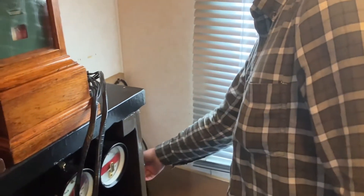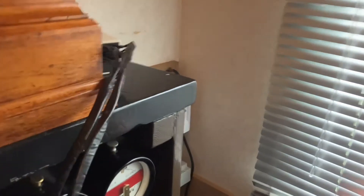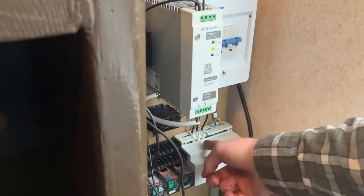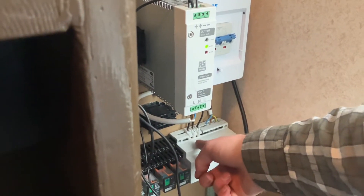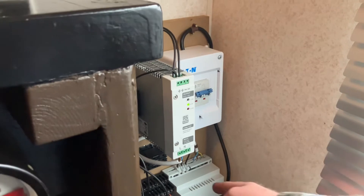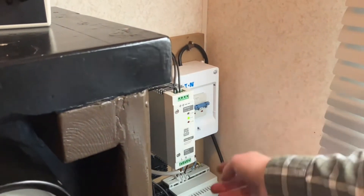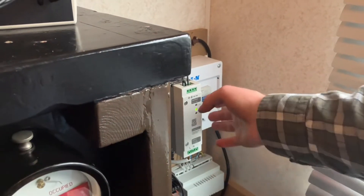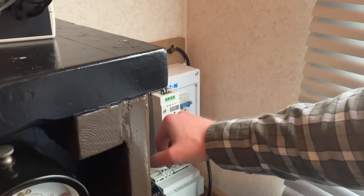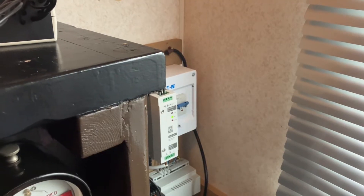I'll send you some photographs of this without it coming around later. You've got 230 volts coming in. You've got a positive 6 volt, a 0 volt return, and a negative 6 volt back to the supply. Everything's fused, both on the 230 side and on the 6 volt and 12 volt side. And here we've got a 12 volt adjustable power supply with fine adjustment for the voltage if it's needed.